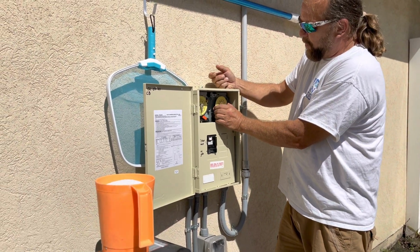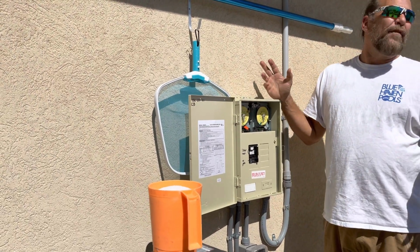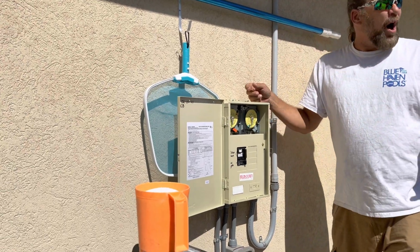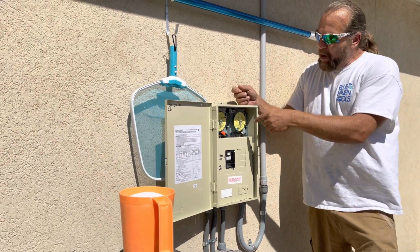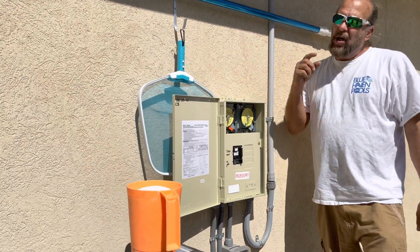Now here's the deal. Do I have to run it on high in the morning? Can I run it on low in the morning, high? Yes, you can do whatever you want, okay? The recommendation is that if the pool sat for 12 hours off from 8 to 8 in the morning, we want high to kick in first. Okay, we want high to give a good heavy push.